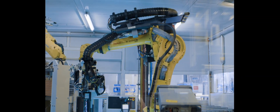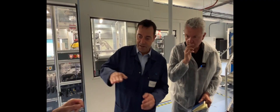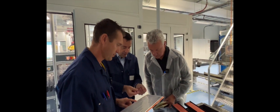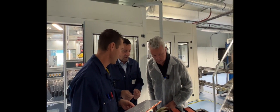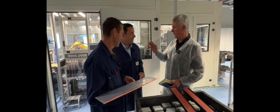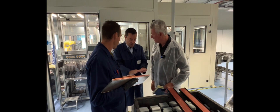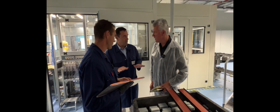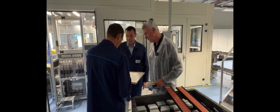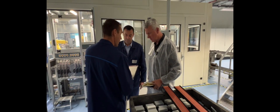At the final layer, we deposit an isolator. You see, we are not using any film. At the end, to connect, you need the copper. With other applications that you have seen, they use copper everywhere. It's copper there, but for the lithium our lithium is a self-support system, so you don't need any copper. And to connect the cell with the battery, we crimp the copper on the lithium side — because lithium has a fusion point around 180 degrees. And on the cathode side, we weld the copper.